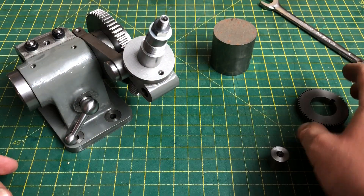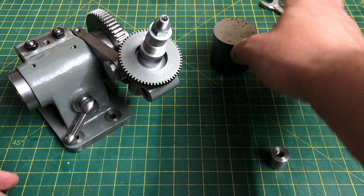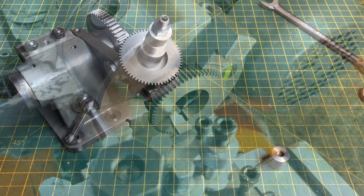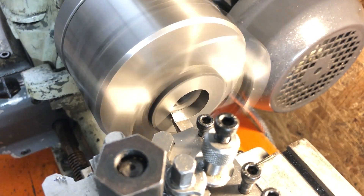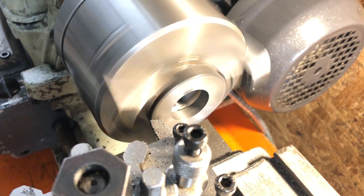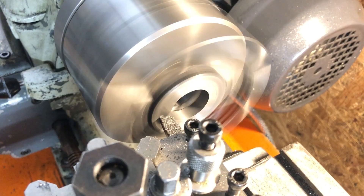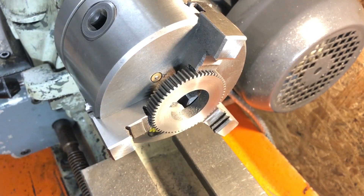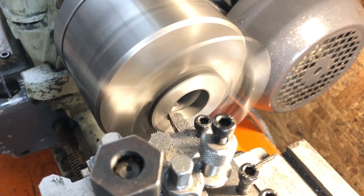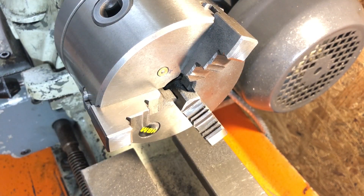The division plate mount will fit here and is essentially a bush for this gear that will also have a register and mounting holes for the plates. The first thing is to clean up the gear and get started on the bush. As supplied, this gear is 4 thou over the specified 5/16ths thickness, so I have material to take a fine clean-up cut on both sides. I'm also adding a steep chamfer to the edges — mainly because I like the way it looks, but it does break the sharp edge. The runout of the bore was so minimal it wouldn't make any practical difference anyway, so I can move on to the bushing.